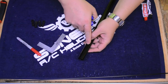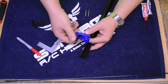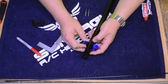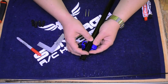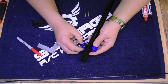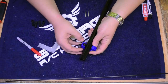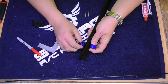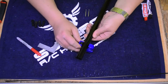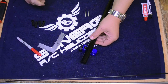I open up my pipe cutter. This is just a pretty simple steel pipe cutter. Make sure you get one that's big enough to go around 22 millimeters, because that's as big as the boom is stock. I put that blade right on that red mark — I'm going to the inside of that red mark, because I'd rather it be a half a millimeter or a millimeter too long than too short. I just tighten up my tool until it just starts to leave a score line — just barely score it — and that goes right through the edge of my mark.